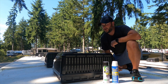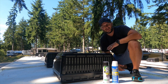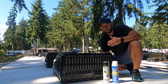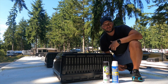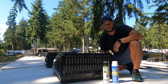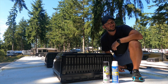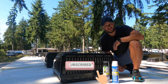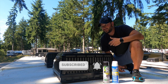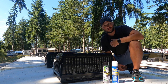We've been full-time for a little over a year now and I have not done this yet. This is something you should do probably minimum, if you're full-time, once a year, maybe even twice a year depending on the climate you're in. If it's real dusty, you're probably going to want to do it twice a year. If you're in a nice paved area, once a year. If you're a weekender, maybe once every other year. You definitely want to do it because the more dirt that builds up on the fins of the condenser and the evaporator, your AC is not going to cool as well. Plus this one is in the kid's room and we're getting kind of a musty smell, so hopefully this will take care of it.